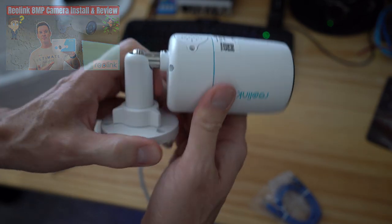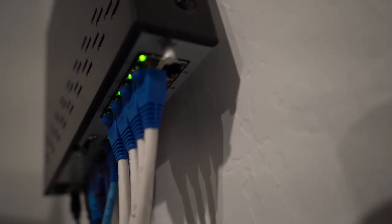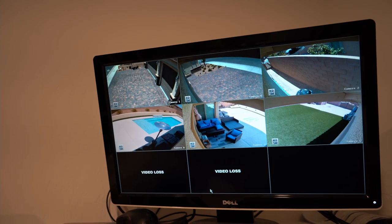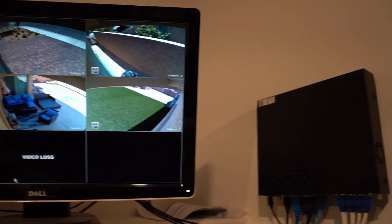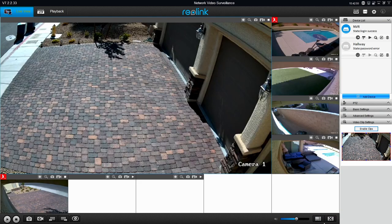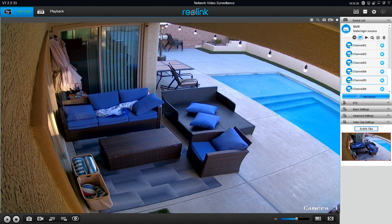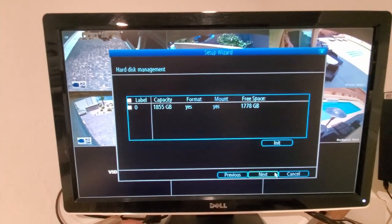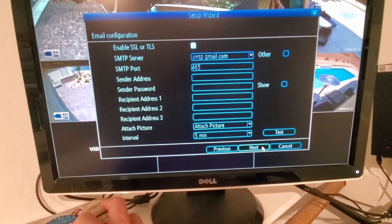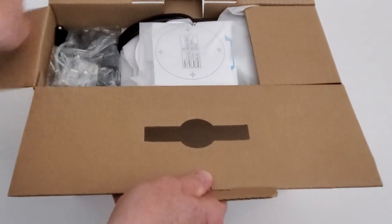Now onto the NVR system. This system comes with 2TB of internal storage with the option to add more. This NVR can connect up to 8 cameras with all PoE connections. The NVR user interface is pretty good; my only complaint is that the camera monitor options are pretty limited. The Reolink client software has many more options — if Reolink is listening, please do an update to add those extra options. As far as the review for the NVR system, it's very easy to set up with a setup wizard. Pricing for the NVR is around $200, however if you get the kit with the cameras and the NVR system together, you're going to save some money, so I definitely recommend getting them together.